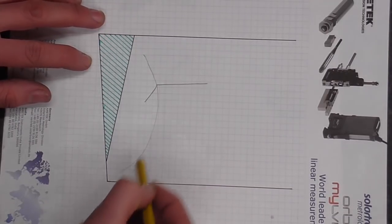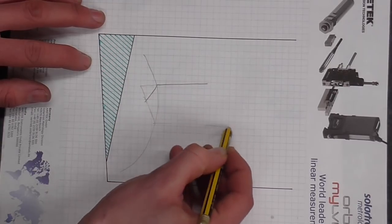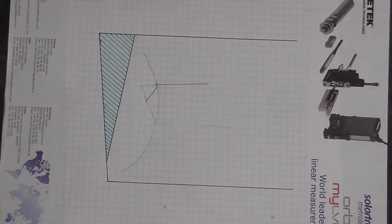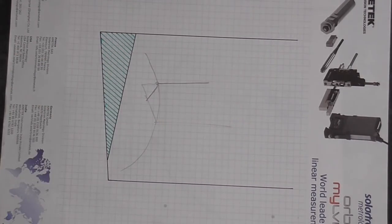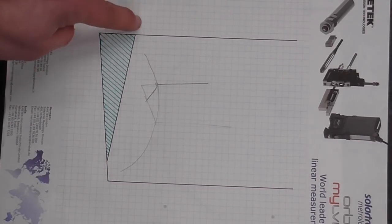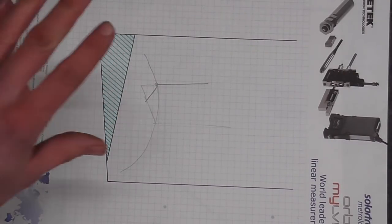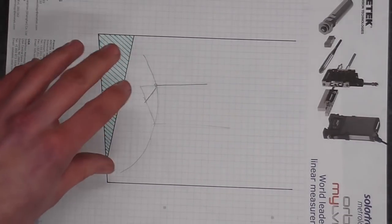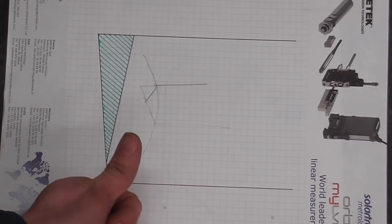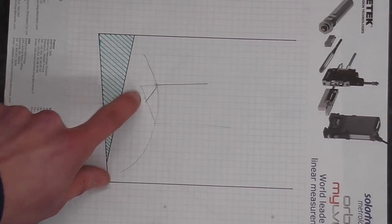So there's the radius of the piston ring's ID. Here's the tool. The actual cutting edge must clear that radius, and that's a rather terrible sketch on my part, but I just wanted to make that clear. Hopefully you understand that the angle of this must clear the arc of the radius as it's working in that internal diameter. It's not something you have to put up with on external work normally, but in this case, because I'm coming in from the side and then undercutting, it applies. And it's similar logic to, say, a boring bar.